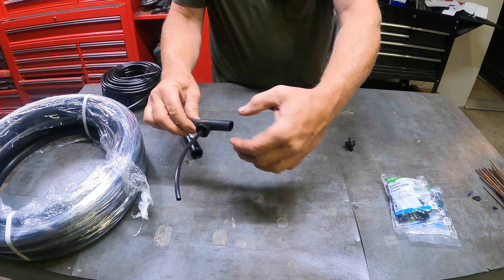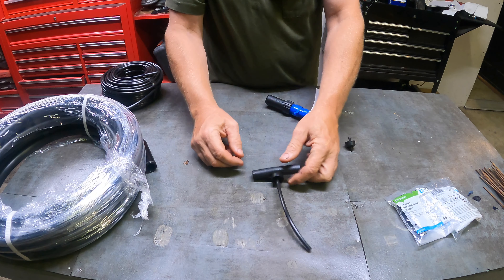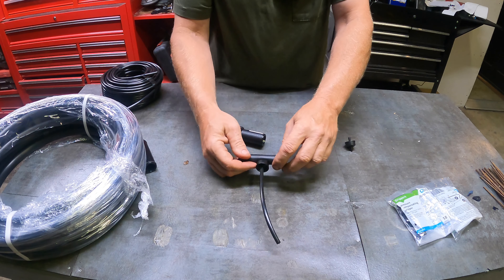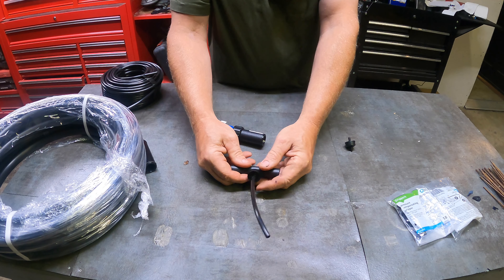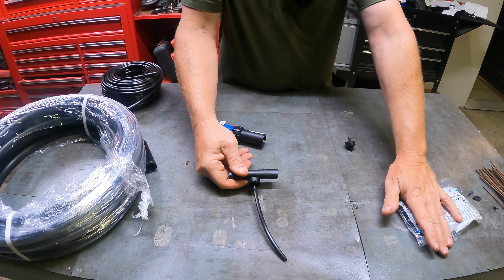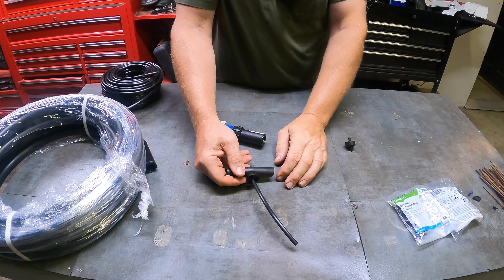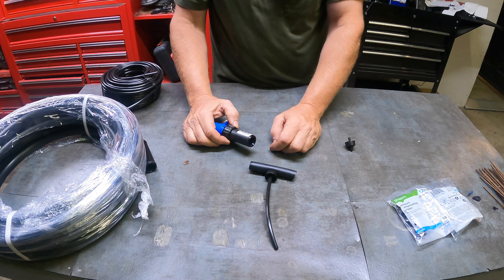You have to keep track of the water output — how much you're going to get with your pressures. You don't want to go too crazy and have too many emitters, but you can get a good amount on a single zone coming through the one-inch pipe, which reduces down to the half-inch pipe. You can obviously fit a lot more one-gallon-per-hour emitters than two-gallon, but you can stretch beyond that — they just might not output their exact rated amount. You can always add multiple zones if you need to.